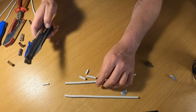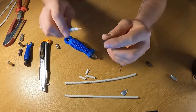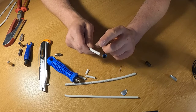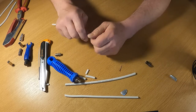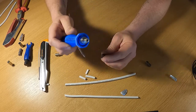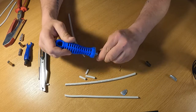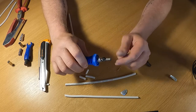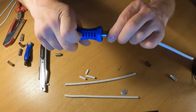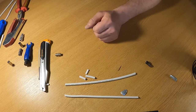Before I forget - this tool here is for when it's hard to screw the F connector on. The cable might be the perfect diameter when warm and supple, but sometimes it's half a millimeter thicker, cold and stiff, making it very hard. You screw the connector onto this tool, then push it onto the cable using much more brute force. Then hold the connector and unscrew the tool - and it's right on there. Much easier.